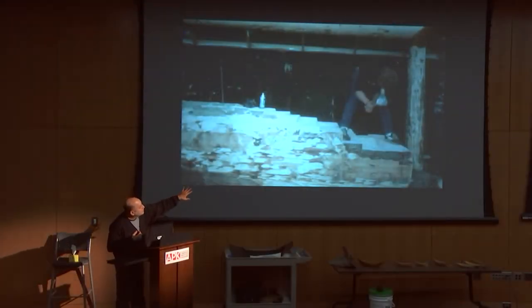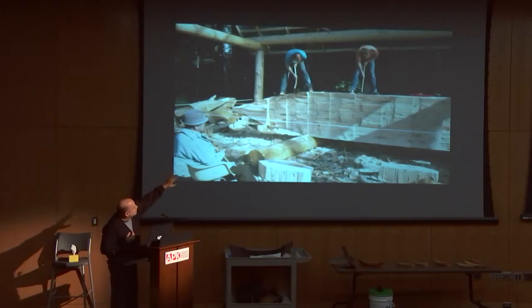So we take the canoe and cut sides. The first thing you do is cut steps and then wedge off. Here is Steve Brown — he's a phenomenal carver. I was an apprentice on this project; I was just lucky to keep chasing this thing for two months. This is where we're starting to wedge off the sides for the front and the back. We've taken the steps and tapered it now — you can see the taper — and it was just a lot of work working the sides.